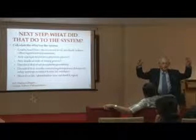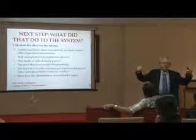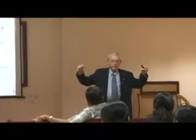However, when we came in, originally, the bus is rated, I'm trying to remember, 42,000 amperes, for short circuit and everything else. And the actual condition was something like 36 or 37,000 amperes. Well, 36 or 37 is comfortably below 42, so it's no problem. However, when you close the tie breaker and you have two sources feeding it, the short circuit duty is something more than 60,000 amperes. Well, more than 60 is a lot more than 42.